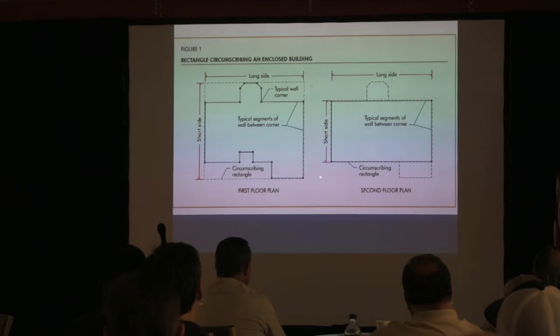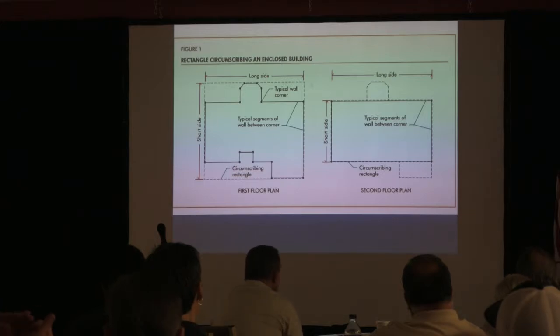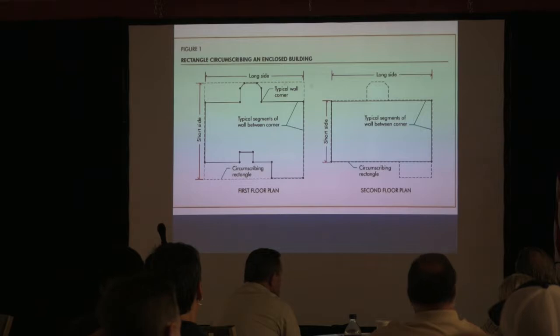And then the table will say, because again, the assumption is you're putting OSB around the whole house. And because that's the most superior method of bracing, and you're using 7/16, they're going to tell you how many panels you need for every wall. It's real simple. Two panels, three. What that means is I may have doors and windows, so I only have two full panels on that wall. And if that's all it's calling for, simple. So that's what makes it easy.